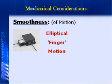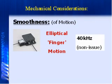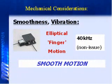How does that affect the smoothness of the velocity or the thrust? Sure. You've got to keep in mind that the frequency this is happening at is 40 kilohertz, so nothing mechanical can even react to it. With the inertia of the slide moving and the motor resonating at 40 kilohertz, you get a nice, smooth, constant velocity out of it. Okay.